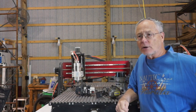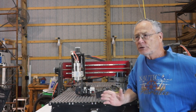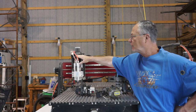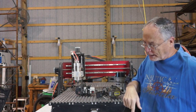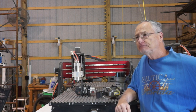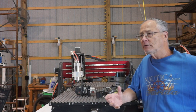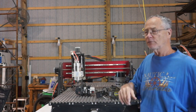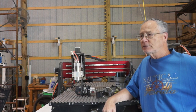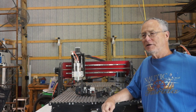I've been asked about spindles online versus the one from Next Wave. The ones online are cheaper and the warranty is shorter, but you have to put it together — solder the leads and connectors, figure out which wire goes where, run it back down the cable, build your cable, and program your box. Next Wave charges $350 for theirs. That's basically the difference in cost. Theirs has a longer warranty, comes complete, and is plug-and-play. If you've got the skill to do it the other way, go ahead and save yourself $350, but I've done it once and I'm not excited about doing it again.